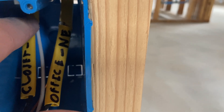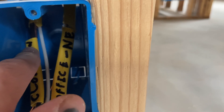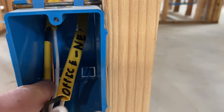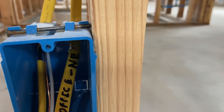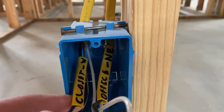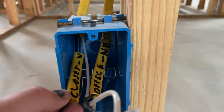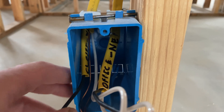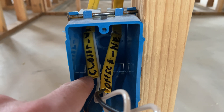You have to leave at least a quarter inch of the Romex exposed in the box before you cut the sheathing off. There's basically sheathing, a layer of paper, and then the wires - the ground wire has another layer of paper around it. Rip all that off. Then from your sheathing, remember the tag you made so you know where this wire is going - cut that off and put it on the hot.